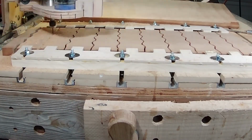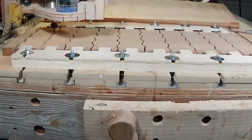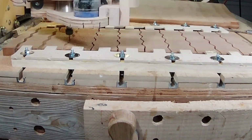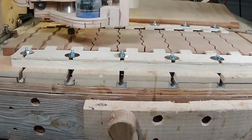The first pass it makes, it's cutting straight down 3/4 of an inch. It's basically hogging out the wood in the middle of the staves. The next pass, it drops down and cuts only 30/1000ths of an inch per pass, and it stair steps slightly out each pass to get that 9-degree angle we want in the end.